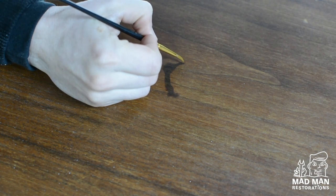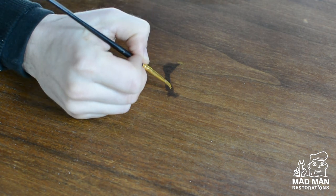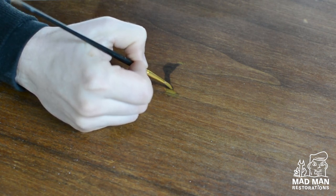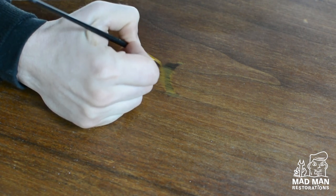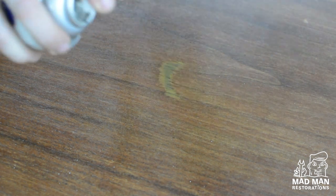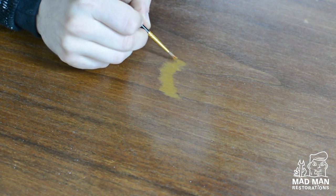To start, I try to match the lightest color that I see in the wood, then I mix my powders with blush retarder and a little bit of lacquer on my painters palette. The key part to in-painting is remembering that you are layering on color — this is a process that takes multiple layers to disguise the problem. That is why in between each layer you spray a quick coat of vinyl sealer to seal that layer in, then work on top of the next. I continued with an additional coat of the same color, sealing that in.